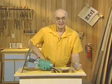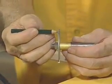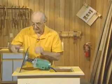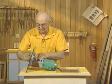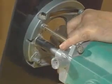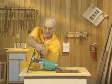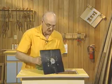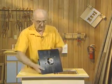This is the slot cutter. This slot cutter sits on an arbor, and it's 1/8 of an inch. So it's going to take up 1/8 of an inch kerf when you cut it. And we got it set in here, and the cutter fits in the router, and I'll show you the big hole plate once we get this chucked up in here. Loosen that up, tighten it down, really good, and make sure it's tight. Now, run it around. And see the big hole plate allows that little space to come through. So we'll just set it there for now.